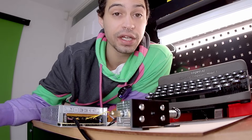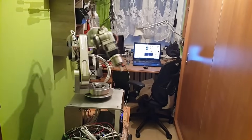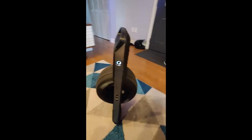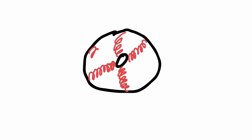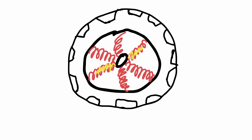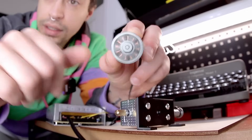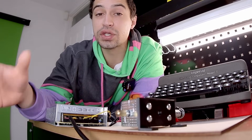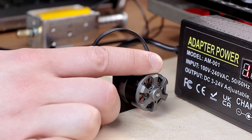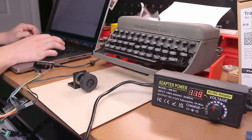Turns out, I was actually looking for a brushless DC motor — and yeah, they're my new favorite type of motors. These are used heavily in robotics, and my favorite example is, of course, my one wheel. TLDR on how they work: it's got this motor with coils inside of it, and the outside rotor has magnets. All you need is a program that can power up these coils sequentially, and this creates a magnetic field that the rotor will follow. The cool thing is, when they're powered off, they're completely loose, and this allows the key to reset on its own. Another cool feature is, if it's actually stuck and doesn't have enough force to pull the string, it will not damage the typewriter or the string — it will just jitter a little bit. Seems quite promising, right? Well, it still didn't work. The motor simply wasn't powerful enough.